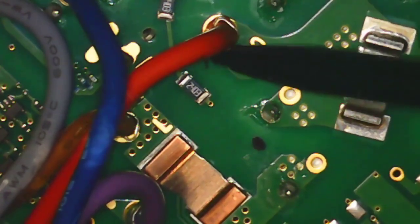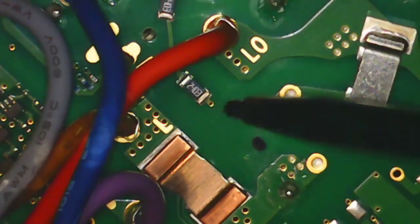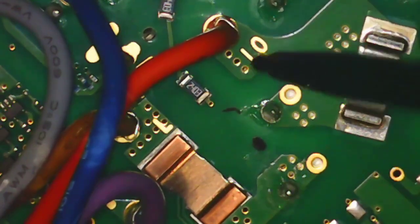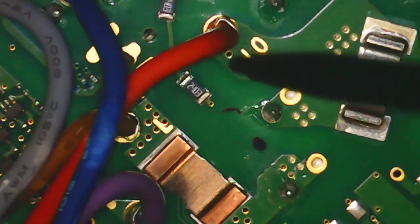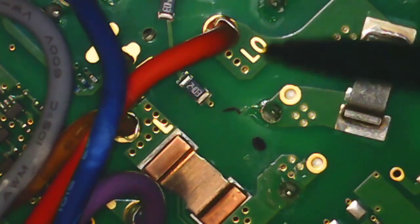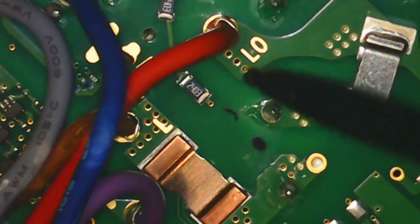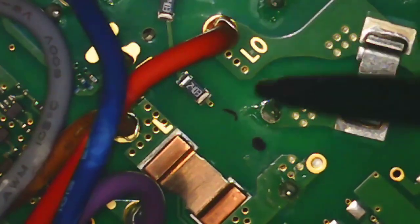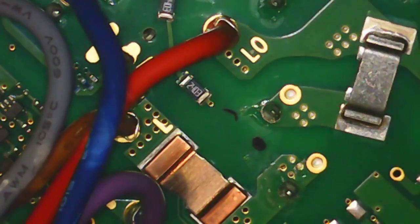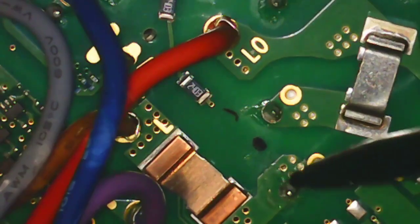Goes to live out. So that relay is not responsible for anything else on the board other than the power coming in and the power going out. So power in, clicks through there, comes round, and that is live out. So there is no way that can interact with anything else on the board. That is the entire live circuit that relay switch is. So 3,500 watts is irrelevant. Absolutely irrelevant.